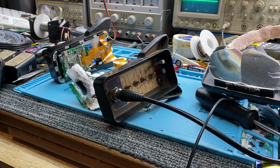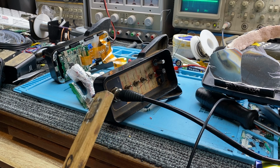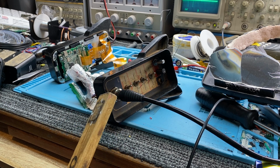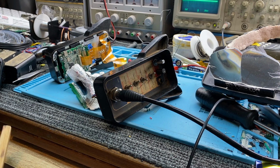I went a little bit further than what I normally would, and got into the nitty gritty of why these detectors require their gain to be reduced. I've come to the conclusion the real reason is that if you run standard 4500 first edition gain, as in built into the electronics, fine gold doesn't work. It desensitizes and just doesn't function. So it's interesting to note that for these detectors you have to sacrifice some optimization, because if you optimize normal mode and enhance mode, you will lose the operation of fine gold.